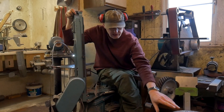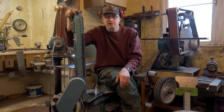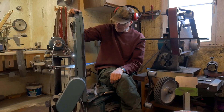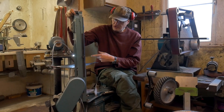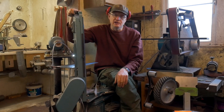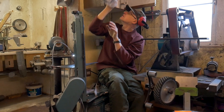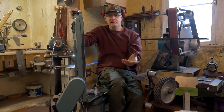There's a piece of G10 there. If you cut G10 with a normal wood cutting blade or a wood bandsaw, within seconds you'll blunt the blades because the G10 has got glass fibre in it — it dulls wood blades instantly. The metal cutting blades last quite a bit longer. I'll generally get through one batch of about six knives — cut six profiles and maybe the G10 for the handles too — and then the blade is basically done. The blades come in packs of five or six. That will keep me going for the rest of this month and into next. It's a good saw for the hobbyist or semi-professional knife maker.